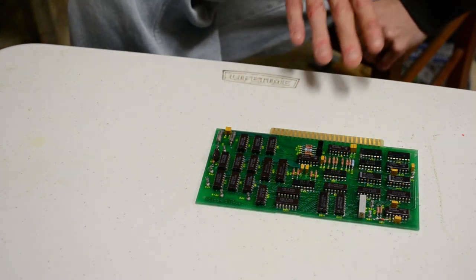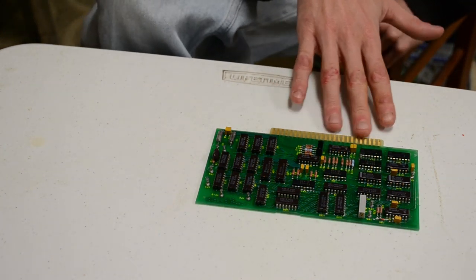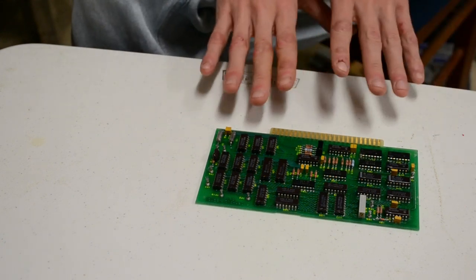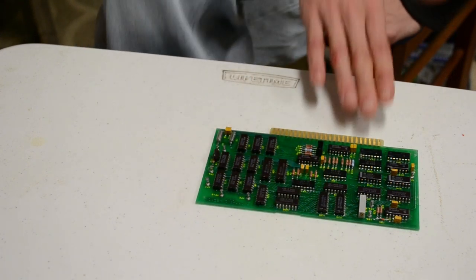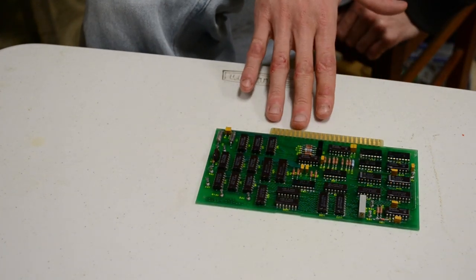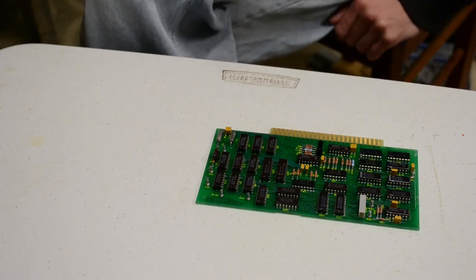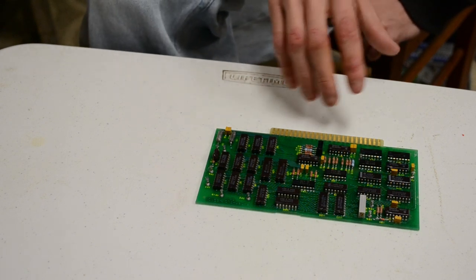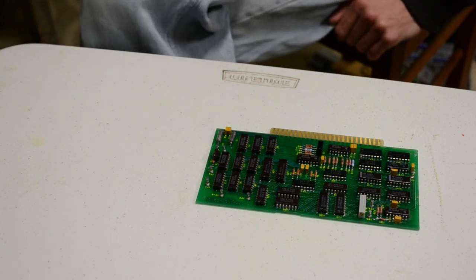And basically, the sync goes in, and there's only one card. So I believe it goes in after it's multiplexed. The two multiplexer cards take all the sync signals, make them a stream, and feed them into here. So sync signals in, and good old binary ones and zeros out the other side, with a whole bunch of headers and all sorts of stuff that lets you say, this is a sync word, this is a sync word, this is a sync word.